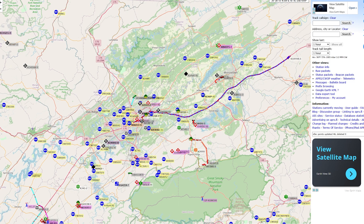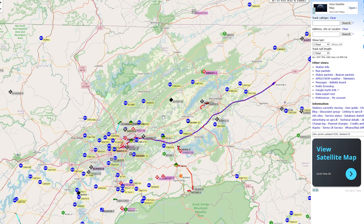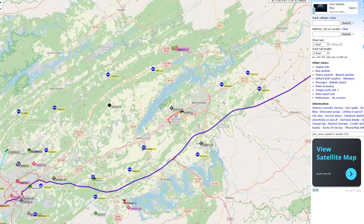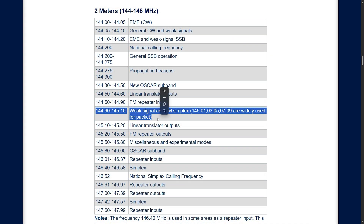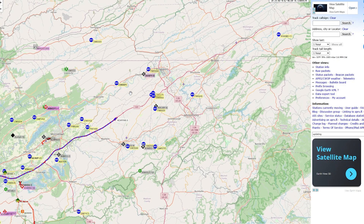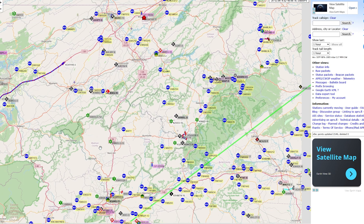Now there's a few things to go over before we get into the demo. If you're familiar with APRS, you know that here in the U.S. the nationwide APRS frequency is 144.390. This APRS BBS is only an APRS BBS because it uses the APRS protocol — it isn't meant to operate on the nationwide APRS frequency. It's meant to either be used on packet radio frequencies or in the miscellaneous and experimental range. There's potential for a lot of traffic with the BBS and we want to avoid creating congestion on that nationwide frequency.